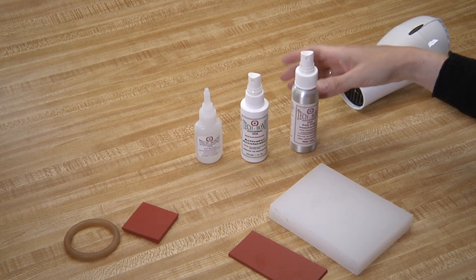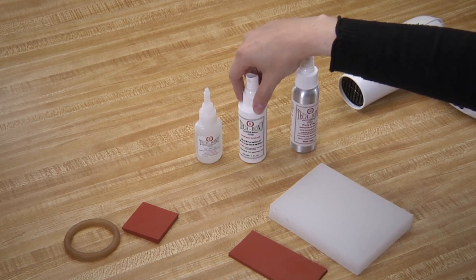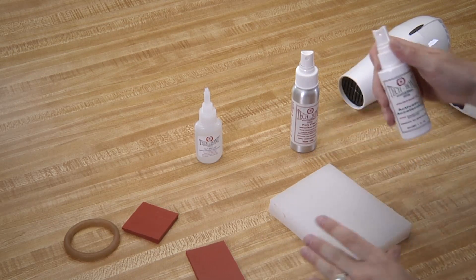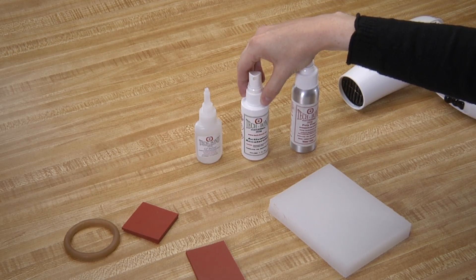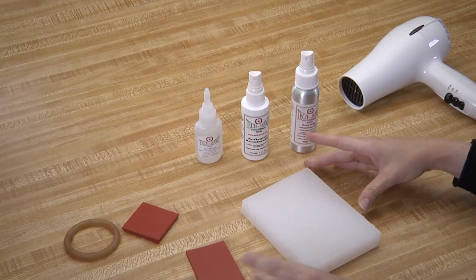Let the poly prep dry. The poly prep dries the oil on the poly surface and etches that surface. Our poly prep is solvent-based, so it dries quickly. It is critical then to spray one of the surfaces with the activator accelerator. In this case, we are going to spray the poly piece. This will intensify the chemical reaction, which is necessary to generate a permanent bond. Make sure you let your activator accelerator dry completely before moving on to the next step.